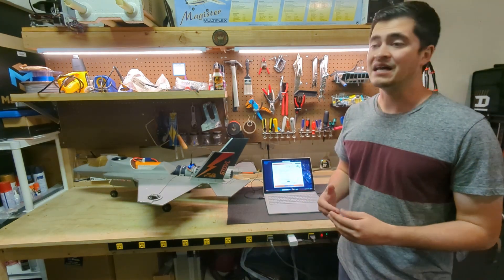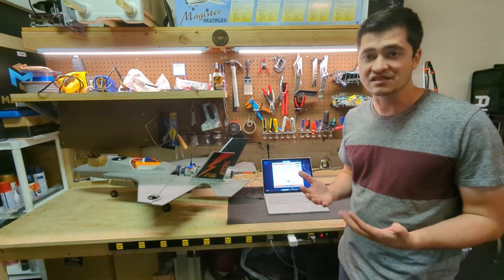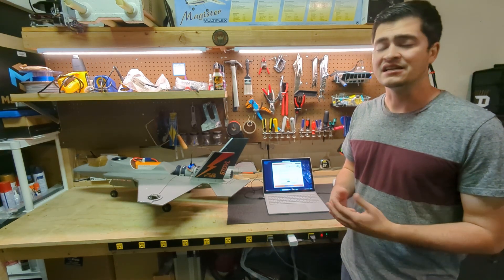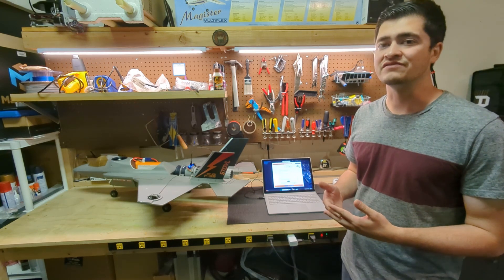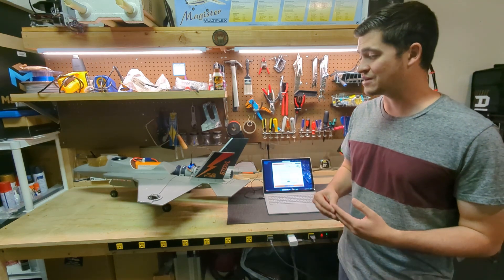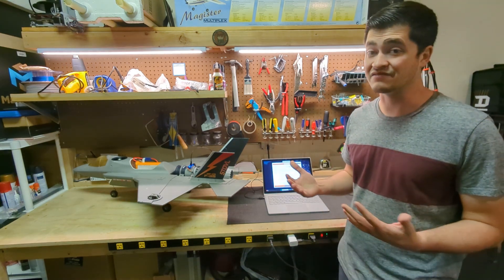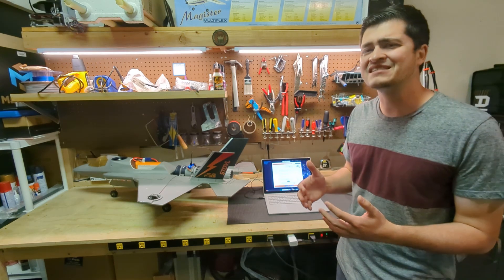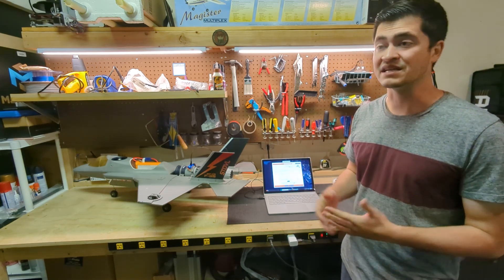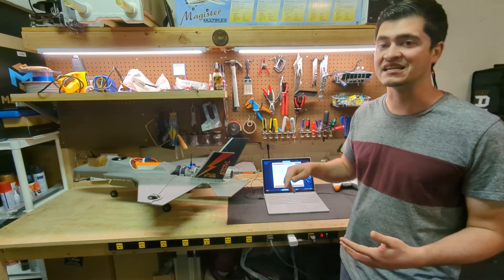This update will now check whether it's getting messages from all of the servos when it boots, and if it doesn't, it'll disable motion commands to those servos until the next power cycle. This way, if you've got the 3BSM control board powered up before the servos and you've done configuration, there's no way to accidentally start moving the servos without them being homed — that'll be prevented until the next full reboot.